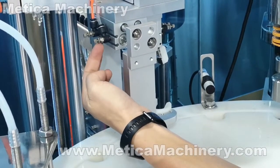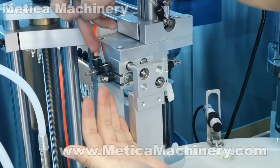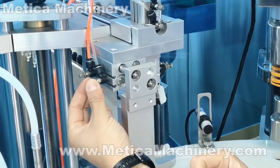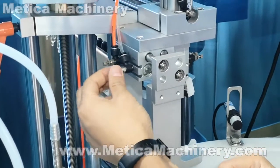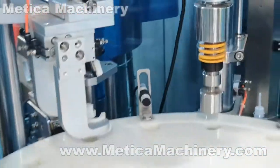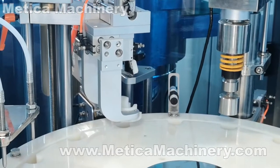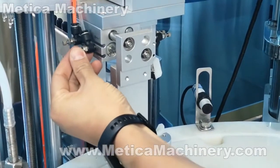You can see this one opens and closes smoothly. Sometimes the cylinder moves very fast, sometimes very slow — this adjuster controls it. When we make this screw very loose, the air is easily pushed out with no resistance, so the cylinder moves very fast. But if we make it very tight, the cylinder moves very slowly — almost no movement.